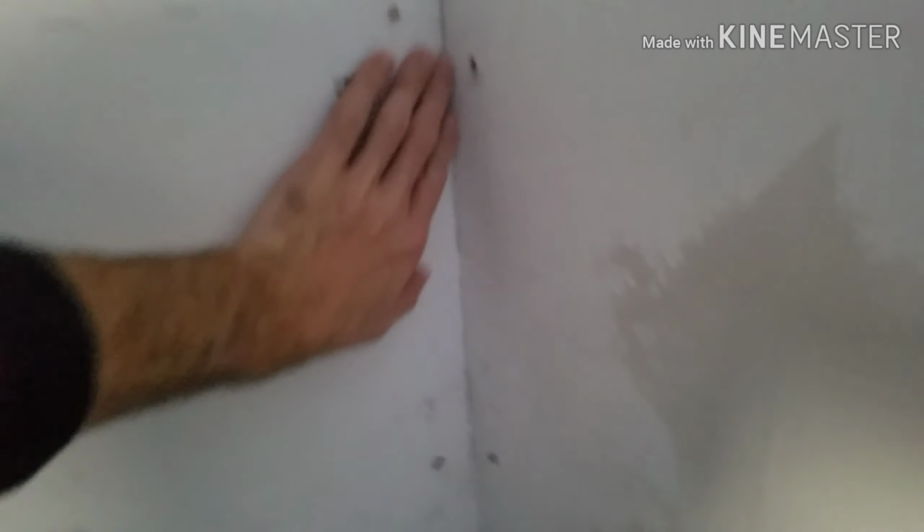So there's that, then this gouge right here. When that dries, I'll sand it down a little bit, get another coat of mud on there, and then probably throw some caulking in there. That's real thin, the paint will probably fill that up. Then his closet could get cleaned up. But that's what I got going on right now.